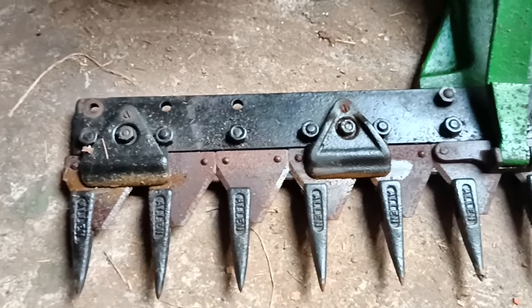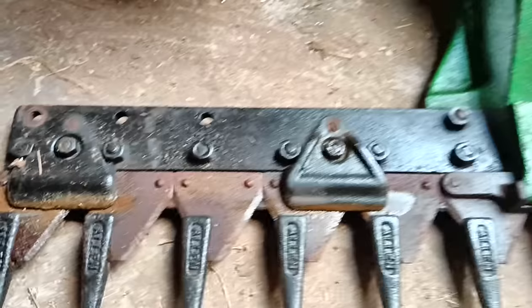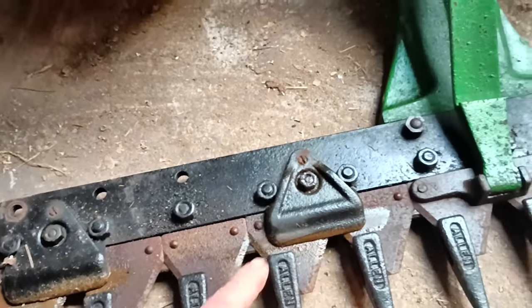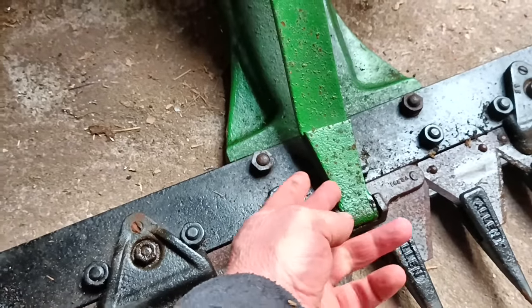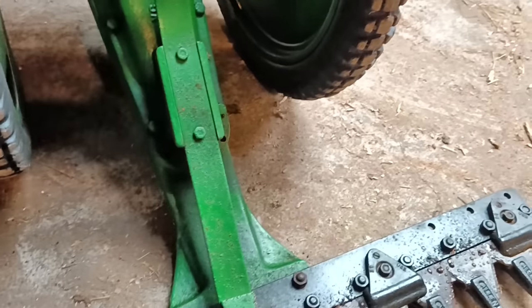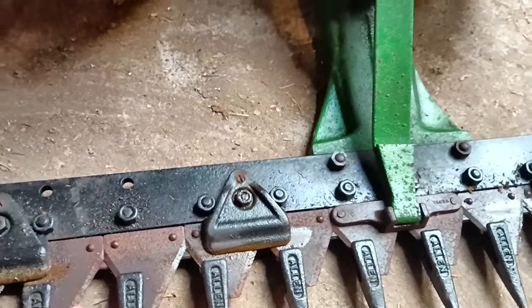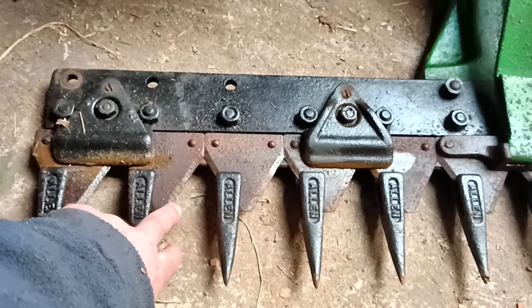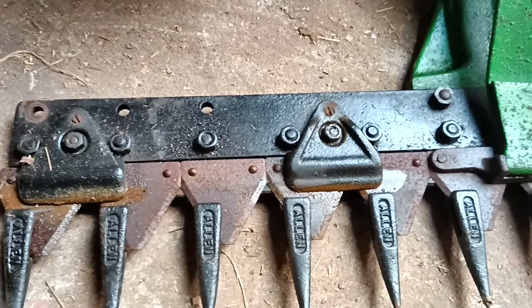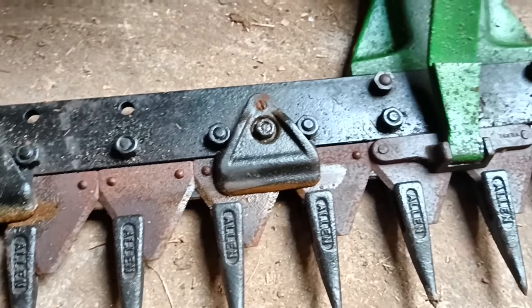One of the jobs to do — Will, you're going to sharpen the blades. Apparently what you do is take off two of these and then lever up this spring. This is okay, it's a bit dry but it should be springy, and then you can slide out the finger bar. They're there but they're not sharp, though it looks like they've all been greased.